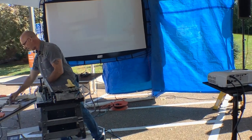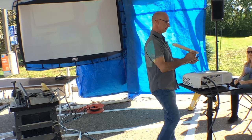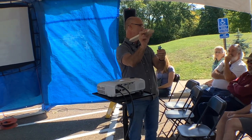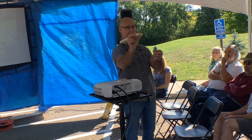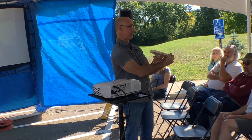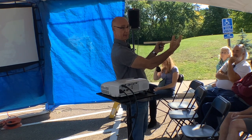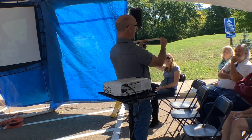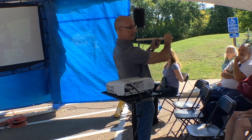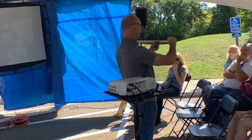We're gonna do the end grain cut first because when I do this, and I exit the side, what could happen? I might get some chipping. When this is still square, it's pretty easy to figure out how to avoid that. If I put another square piece behind it, I can stop it from chipping. If I've already cut that complicated long grain profile, then I cut the end grain, it's difficult to support that profile and prevent the chipping. So we're gonna always do end grain first.